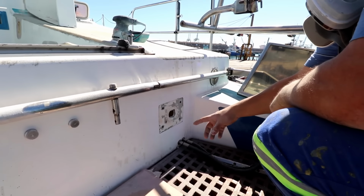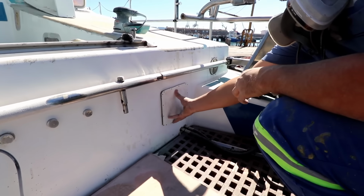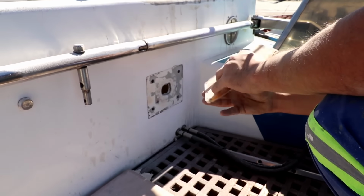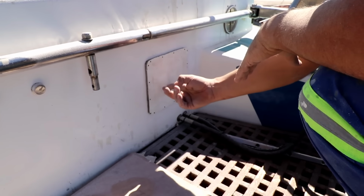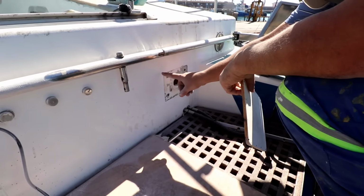So that's where our davit mount goes, and the old one was a piece of wood that was all stuffed up. So this one we'll still gotta put a layer of flow coat over it and do the edges nicely. But the idea is that would go over that, and then we'll drill all the new holes. And that also distributes the load a little bit wider.